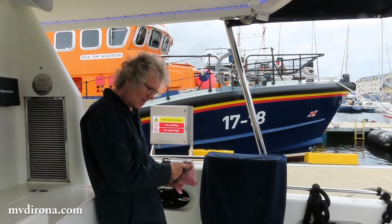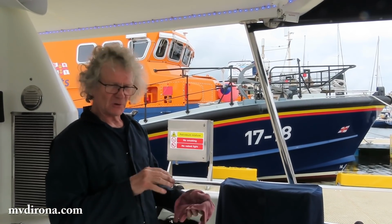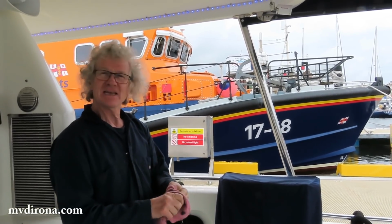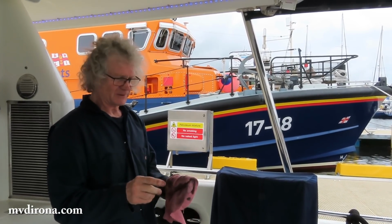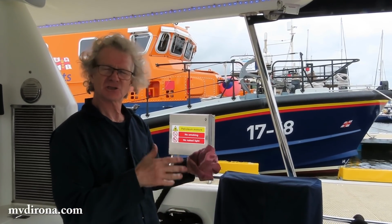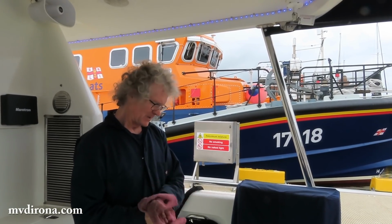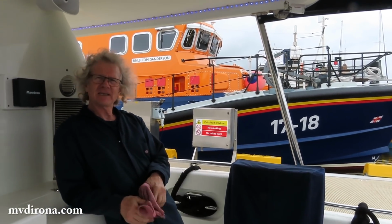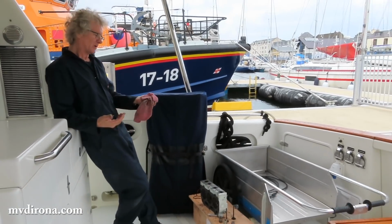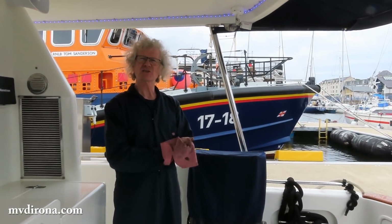I think there really is a lesson here for us, Jennifer. We just have to remember, if the boat ever gets really beaten up in tough seas, and we both do our best to avoid that, but it happens, probably the right thing to do is run the wing, run the furnace, and run the generator sometime afterwards, just to make sure there's nothing wrong with it. If moisture did get in, burn it off. I feel like I should have known that already. On one hand, a design shouldn't have that flaw, but on the other hand, wet exhaust systems always have a breaking point. They always have an angle that's just too much for them.